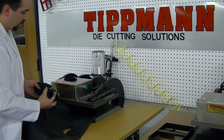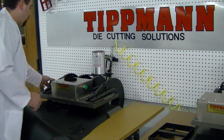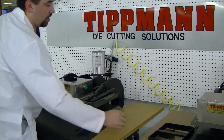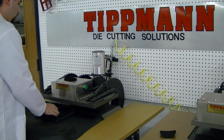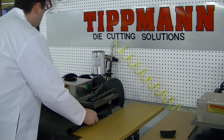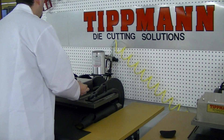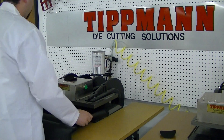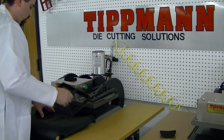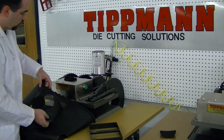I was having problems with it not cutting right where the weldment is on the die. You might want to have your die maker take a look at that. I had the same issue with the corners on this pink edge die — it cuts cleanly all the way through except at the corners.